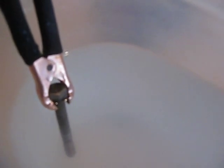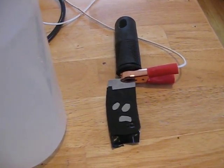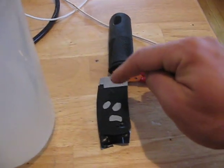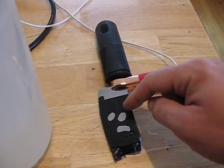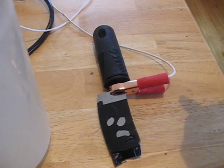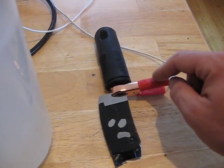You can vary the size of the cathode depending on what you're etching. It helps to have roughly the same surface area on the cathode as the piece you're etching, but it doesn't really seem to matter. This is a very inexact process — as long as you get the basic setup right it should work. And onto the anode: it's actually a crappy knife I bought from a dollar store just to practice on. I've wrapped it in black electrical tape and cut some random holes in it to simulate animal footprint designs. This is connected to the anode or positive lead of the power supply.